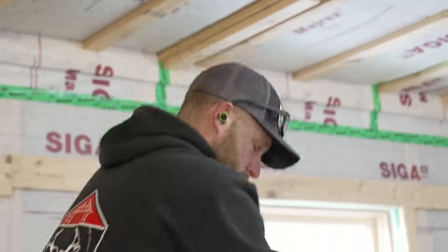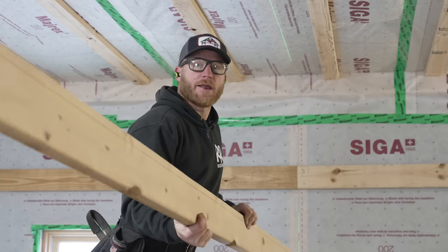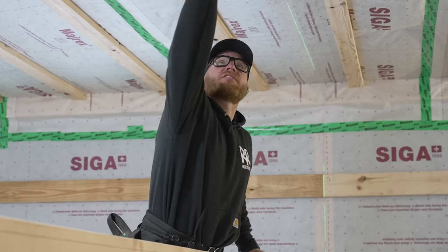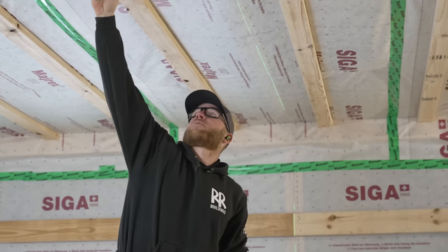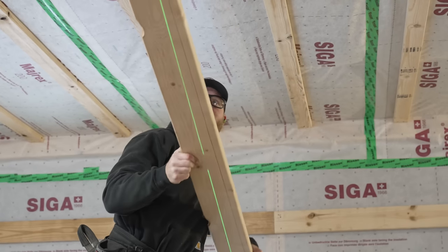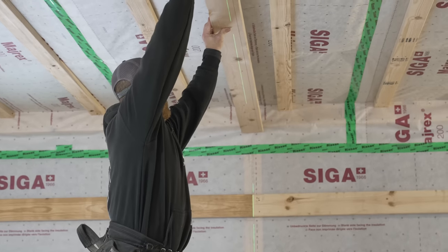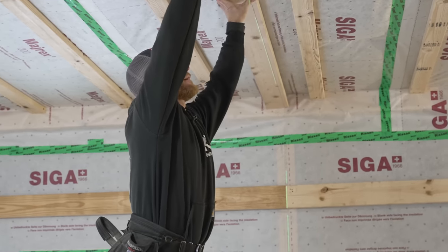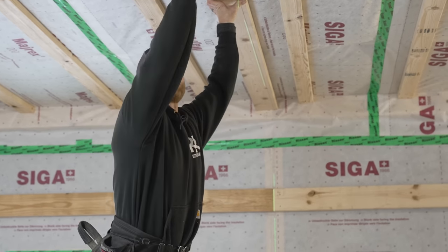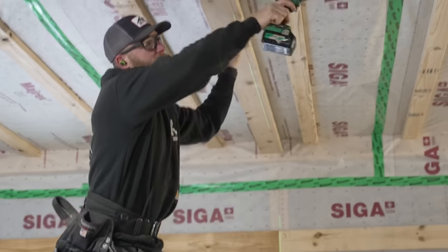Because we're using 2x4 walls, this laser line is the wall plate line. But since it's going to be up in the same plane as the ceiling girts, I need a drywall nailer. So I'm going to take a 2x6 — I've scribed a 1-inch line on it so I can line that up with my laser. The goal is that when my wall plate gets put here, I'll have a 1-inch drywall nailer for my drywall guy when he's doing his ceiling.